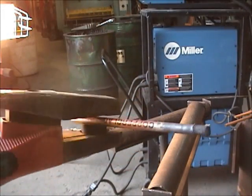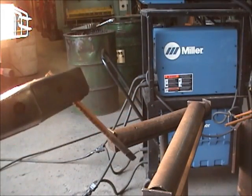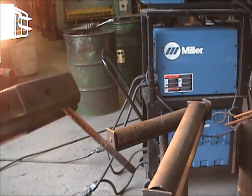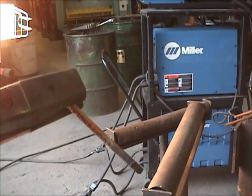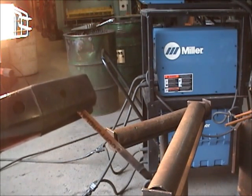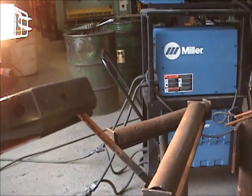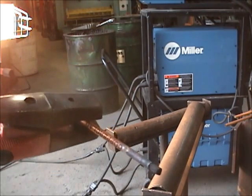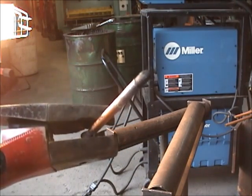Okay, so here's the rod that's been used. It's sticking out about 6 inches and it's ready to go. I don't run any more than probably about four to six inches out the front at any one time. You don't wanna get too far away from the end of it, because you're gonna lose the velocity on the air if you run them down too far.